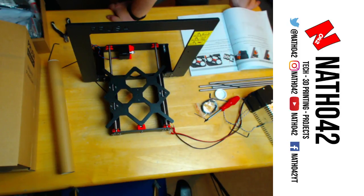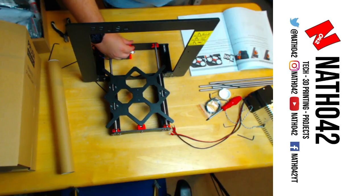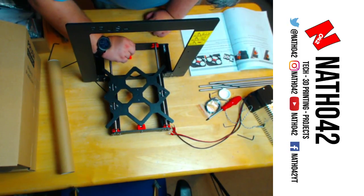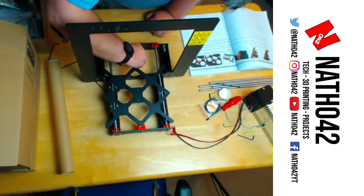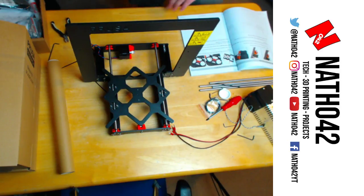One of the screws must be facing directly against the flat of the shaft. Slightly tighten both screws. Okay, so this is really small, so we'll use this one maybe? No, it's not that small, it seems. Don't press the pulley against the motor, leave a gap so the pulley can rotate freely. Yeah, there's about maybe a 2mm gap there. Hopefully that is big enough. So we take that back, tighten the other screw. Okay, so hopefully that is good enough now.